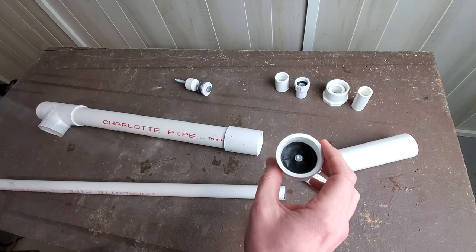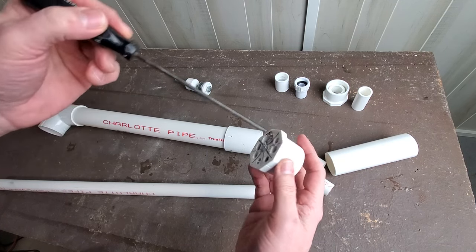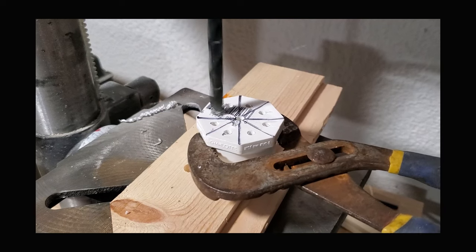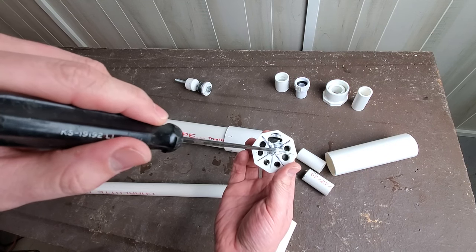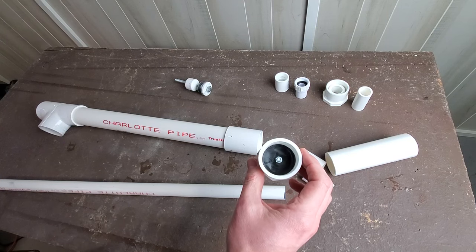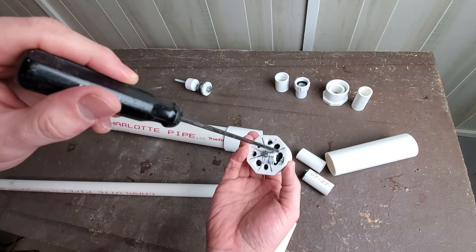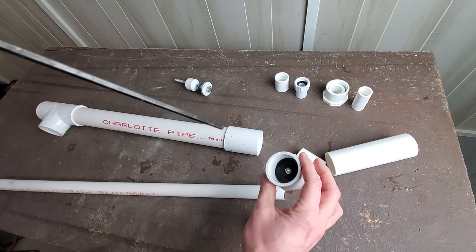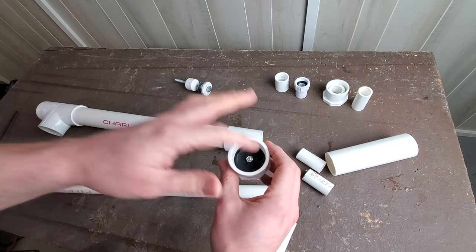What we've got here is a rubber seal that can only allow water to move one direction, and this is actually the only rubber piece in the whole pump. This plug has a bunch of medium-sized holes drilled in the bottom, and then a smaller hole right in the middle. Through that is just a small bolt with a nut, and that holds the rubber gasket in place. When you pull the plunger out and water needs to rush in, the force of the water and the suction motion push this rubber seal out of the way and allow the water to come in. But when we push the other way on the plunger, we're pushing water against this seal and it can't move in the other direction.